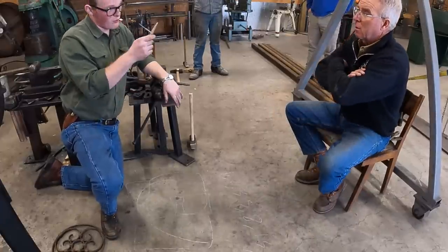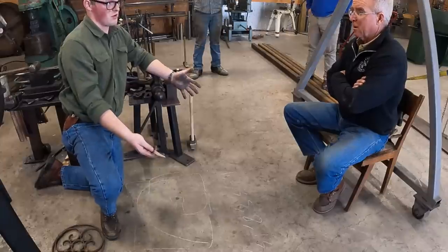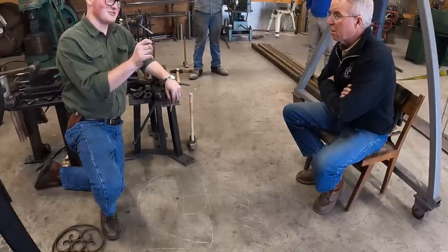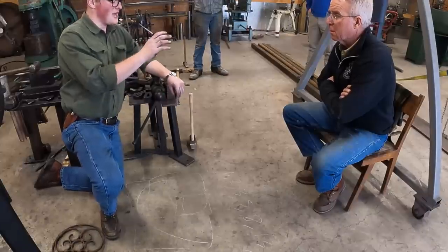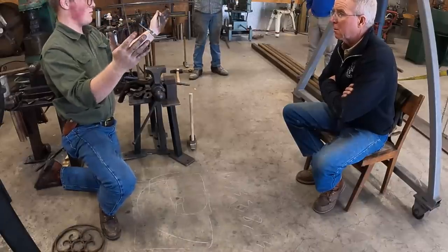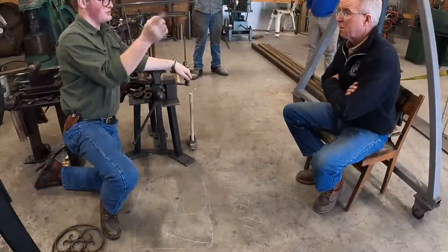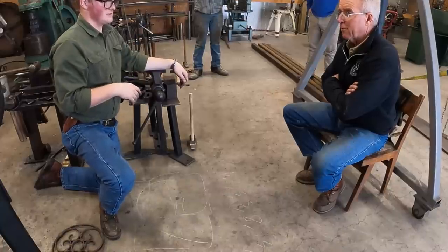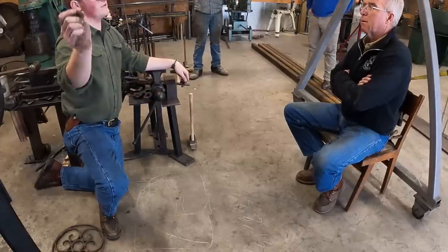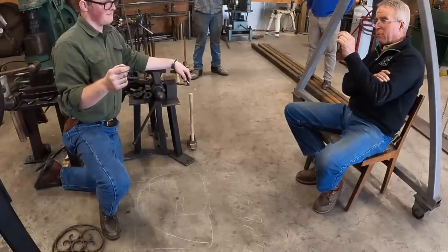But the important thing to consider is that's no longer the golden ratio, or that's no longer the Fibonacci number that's getting closer to the golden ratio. Well, what I've done is not quite getting closer to the golden ratio. Imagine if you've got a ratio and you multiply it by two. Same ratio, right? What if you add two to both sides? Different ratio. It's a different ratio. Yeah. And that's what you're doing with a piece of quarter inch flat bar, is you're adding a quarter of an inch. So you're changing the ratio. Oh, you're adding the thickness of the material around the outside of your jig, right?